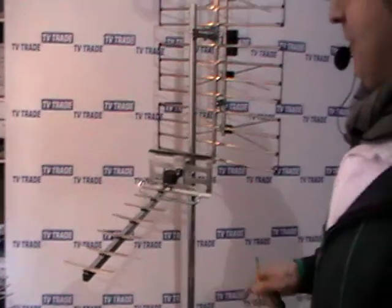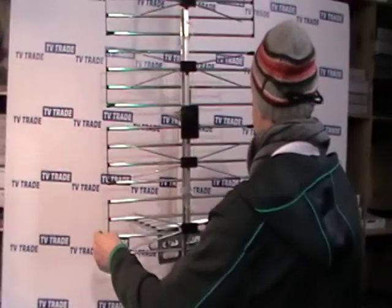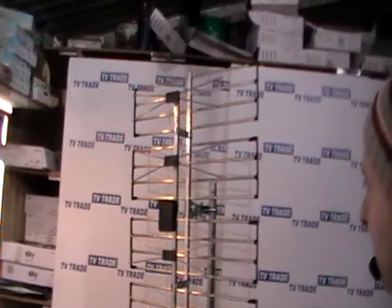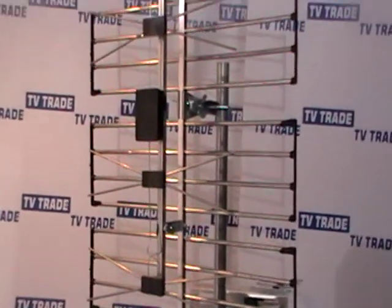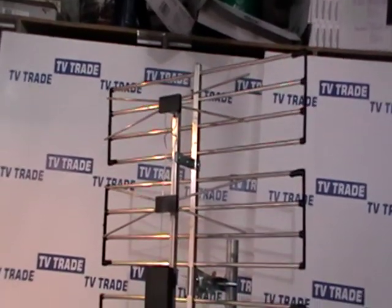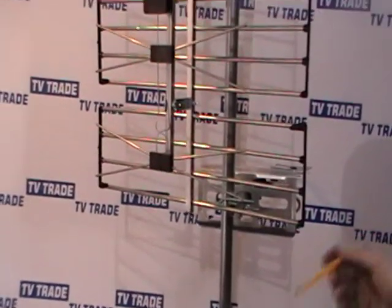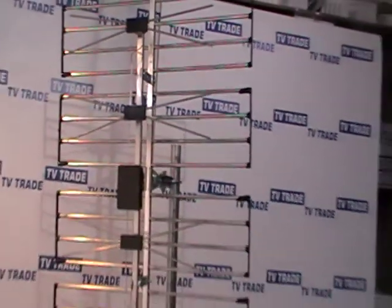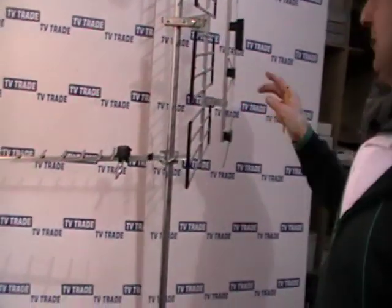To step up from there, particularly ideal for people who aren't sure what transmitter they're going to use or fear they're in a bad reception area, this is called a grid UHF aerial. It's about three to four times the price of the other aerial, but it has the advantage of a huge gain. The grid on the back reflects away signal, so if you have a lot of interference in your area this will work well. It's probably the best aerial you can buy for this job, but the disadvantage is the cost and it's also a little bit more bulky and unsightly.